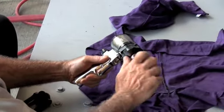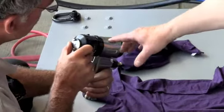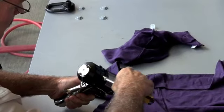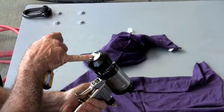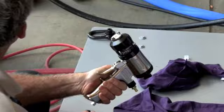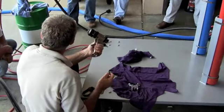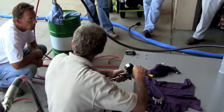These guns are made so you run the material underneath that cap, then take that cap off. Even when you're triggering it, at the last release of the trigger, it also releases air at that same time. That's pretty good. So what it's doing — as you're triggering you're running the material, but when you release, it actually hits air out to clean the gun. Yes, that's basically what's happening. So you don't have to purge with air again — just keep it clean. You'll see it when we spray.